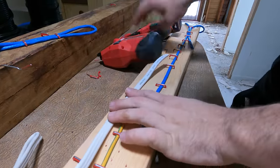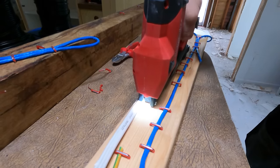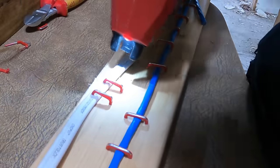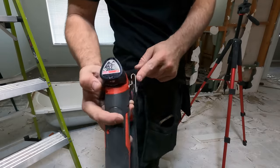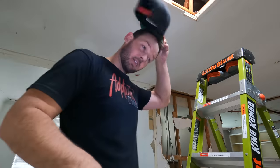One thing people wanted to see was the staple going through a cable - obviously it's going to happen, it's not if but when, especially if you give it to an apprentice. If you put the stapler down that side straight on - there she goes. If the safety trigger isn't engaged she's not going to fire, so you've got to be half on it. You can go through cable pretty easily and once you've done that it's a dead cable. It's also got a belt clip - the larger style which I like - easy to get on and off, but if you're crawling through a ceiling that's not going to help much.